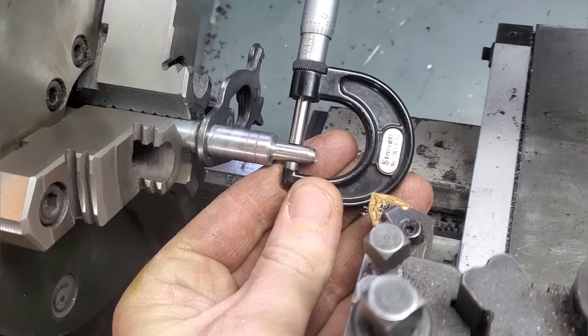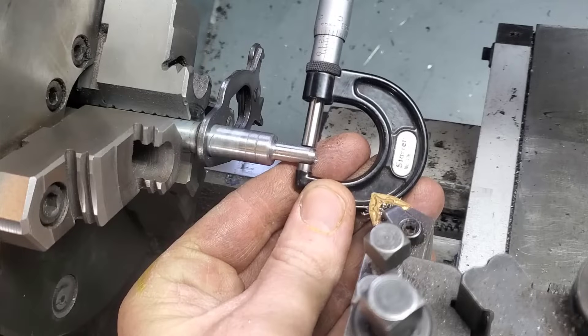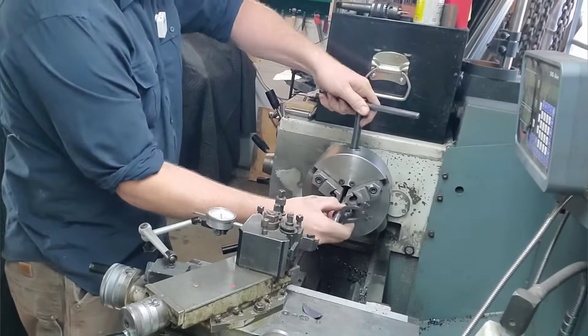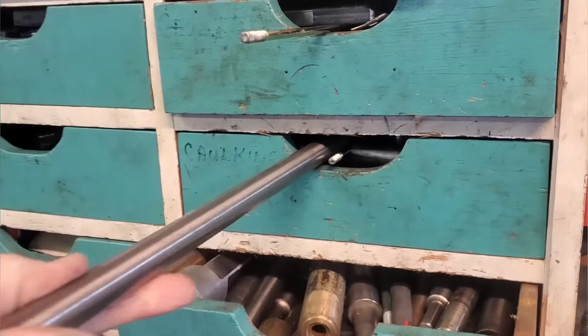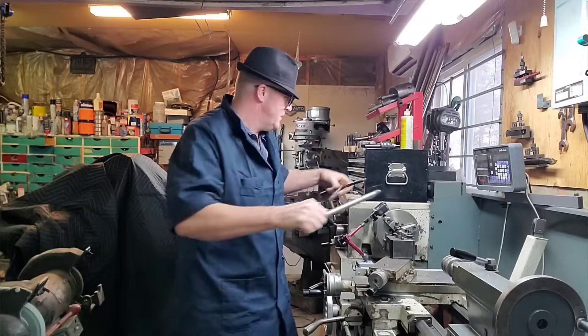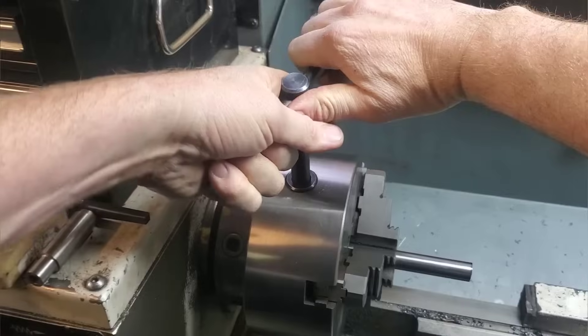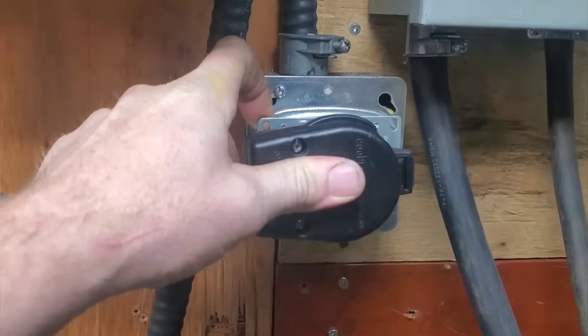What I'm doing now is turning down all of the spline that was already damaged, and I'm gonna make sure this is gonna be straight all the way across, because I'm gonna take this bar and actually make a collar that goes over top. This bar is 1045 steel, which can be hardened reasonably hard, and it'll actually work harden as it goes.